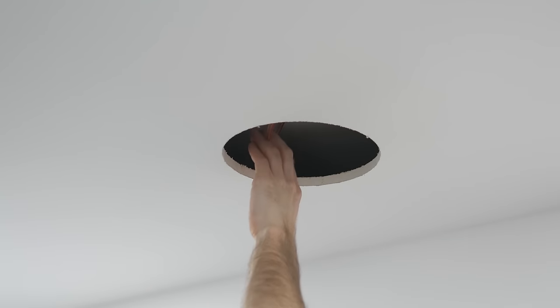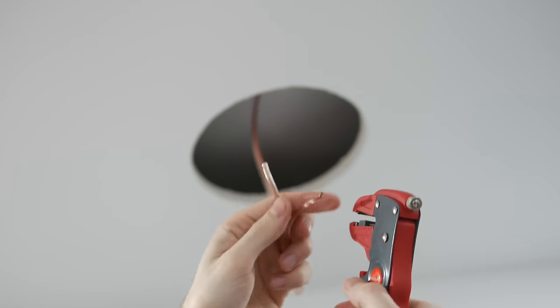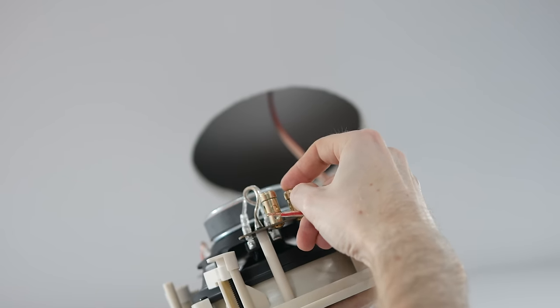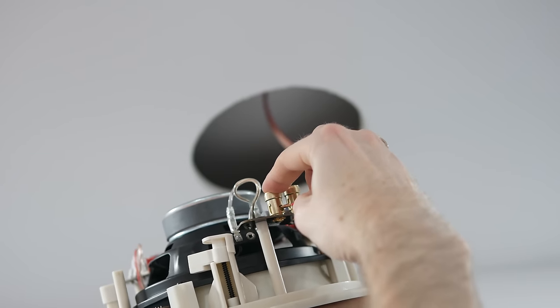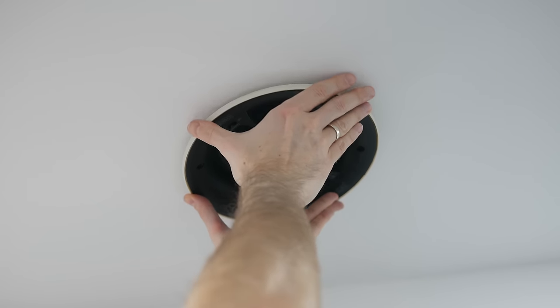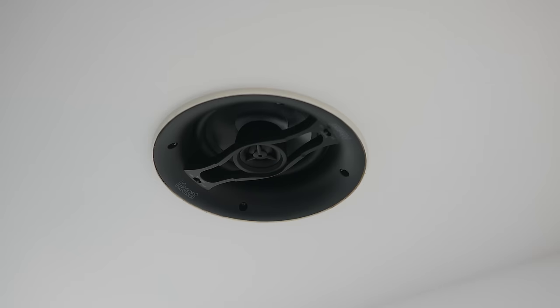Don't rush it — it will be a bit messy, so have a vacuum cleaner ready. After cleaning up, get back on the ladder and extract the wires that your contractor left for you. Strip the insulation. Take the speaker, push the wire connector down, insert the cable, and release the connector. Do the same for the other cable, making sure you connect the red one to the positive speaker connector and the other to the negative. Insert the speaker through the hole, work the screws to secure it in place, and put the cover on.